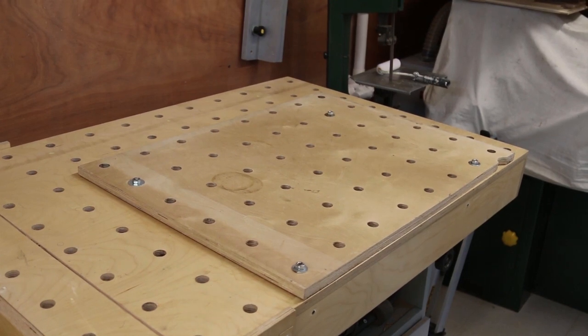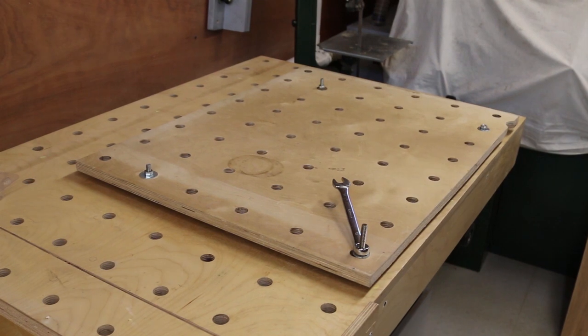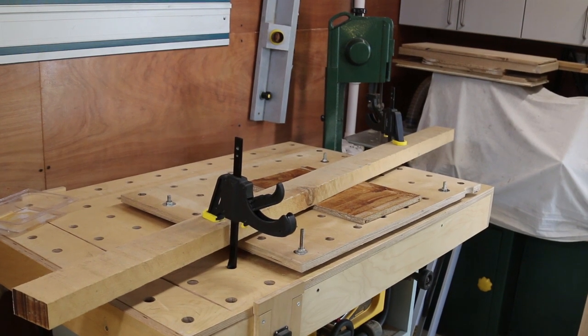If you used a template to cut out your MFT table, here's another use for it. Bolts through that and the table give you a large clamping area. The veneered wood was slid in underneath and the clamps tightened, and then additional pressure put on the centre.